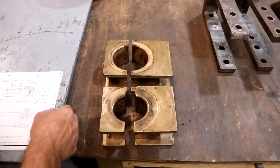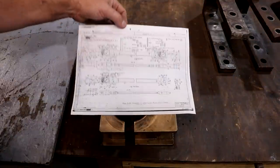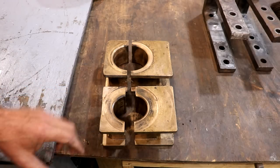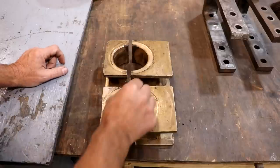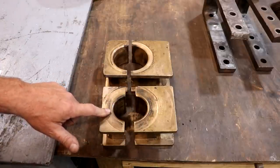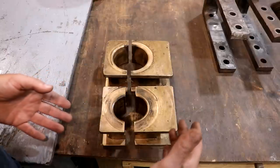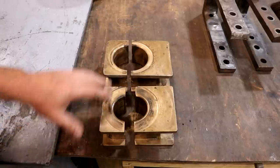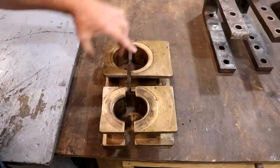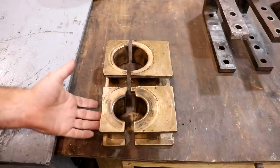Thanks to the Pennsylvania Railroad Museum, who has the original blueprints for Vulcan Ironworks, they've been able to send us the original specs to work off of. You can see the big gap — that's where the bearing has worn over the years. As they've worn, what we've done at the museum is put shims on either end to keep the length of the rod the correct length. Our goal is to get these new bearings in — there's still some material left, but they're getting very close to the end of life.